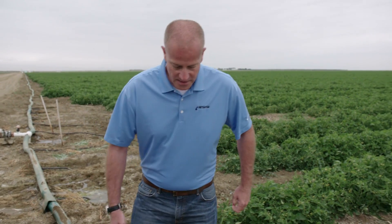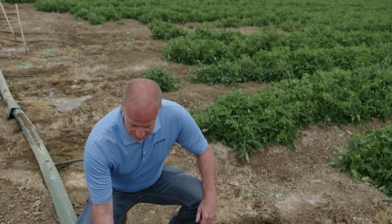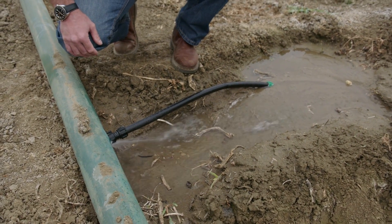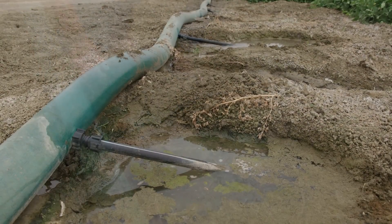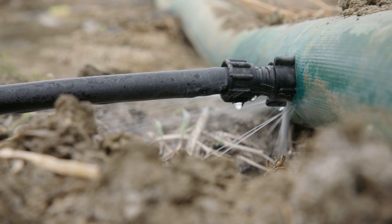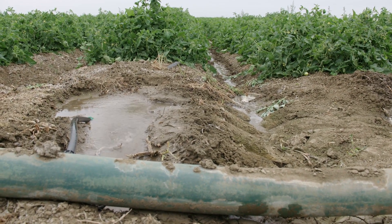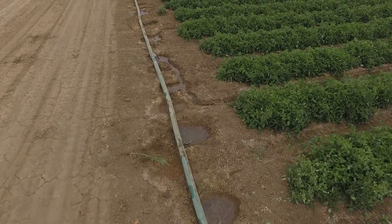What's happening here is the connection to the lay flat. When the lay flat is installed, they punch a hole in it and make this connection. When you cut the hole in the lay flat, it actually disturbs the weave of the lay flat, which when pressurized inherently stretches around that hole. It's kind of impossible to control, and causes leaking almost immediately.